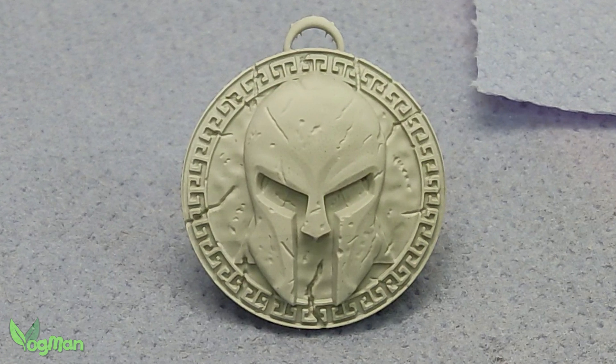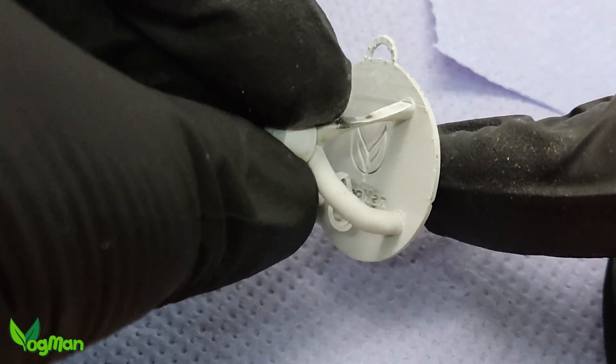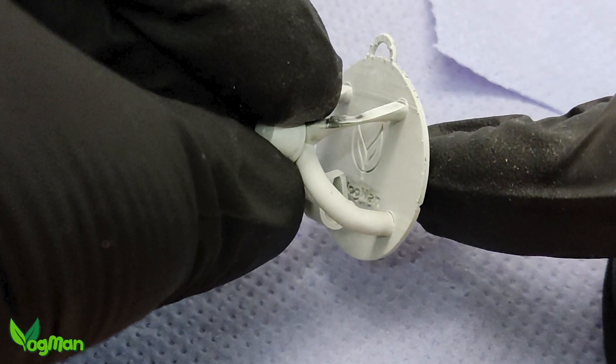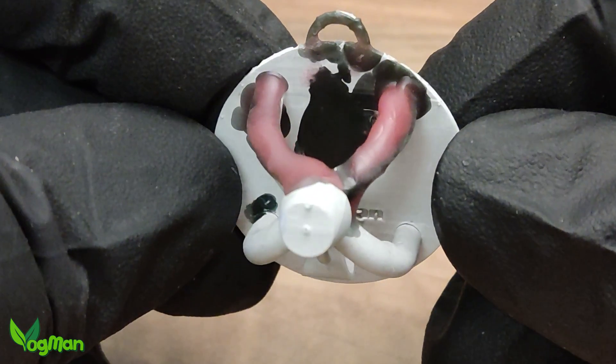Things up till this point had gone great. Now came the downward spiral. You'll notice that not all of the sprues are fully formed, and that's not the fault of the resin or the printer - it's obviously my fault on how I supported it. The remedy is simple enough, I just needed to thicken these areas using sprue wax. I did manage that, but I also managed to break the hoop at the same time, which I had to glue back on with wax, and in doing that I dropped a big blob of wax all over the logo. All in all, a bit of a mess.